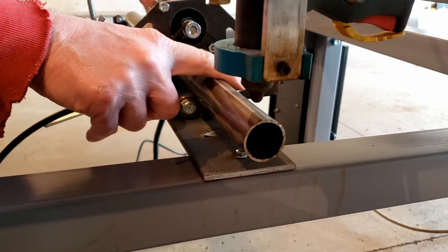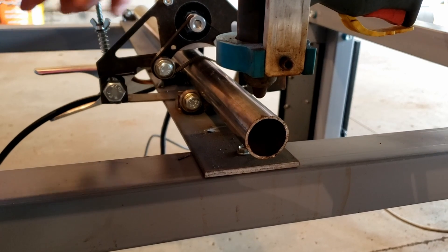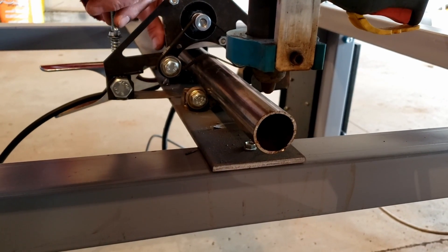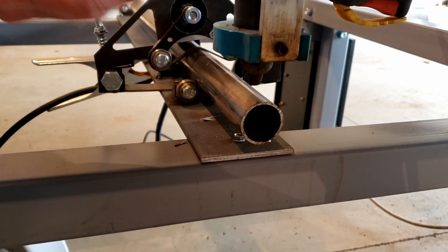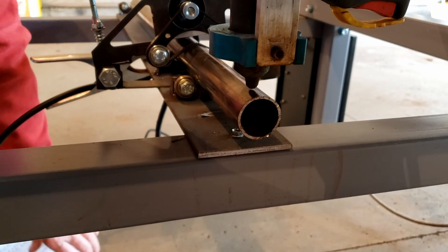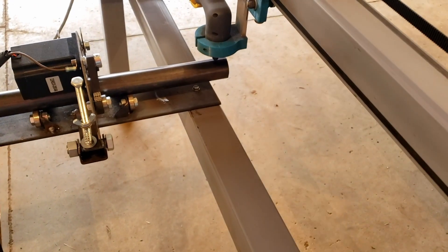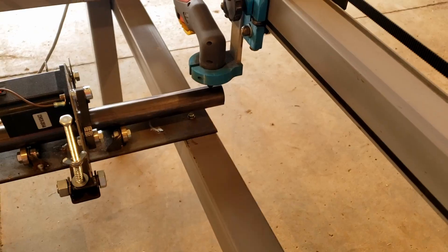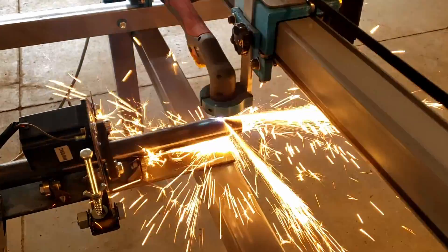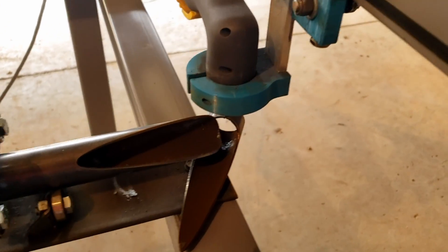Getting the nozzle on — we were just running two-inch here so I need to tighten it up a little bit for inch-and-a-half. I drop the tip down and then we're ready to run the first notch, which is going to be a real deep 15-degree notch. That's the type of cut you just won't be able to get inside a tubing notcher. Look at that nice cut — so beautiful.